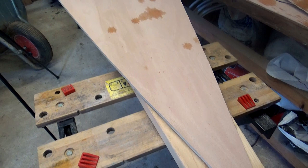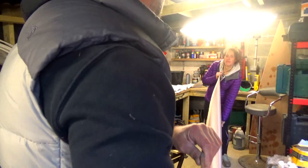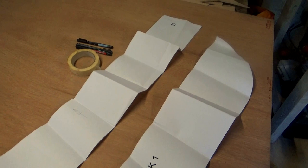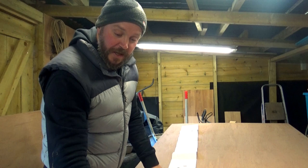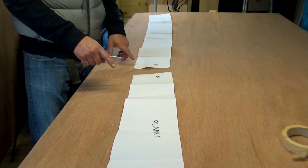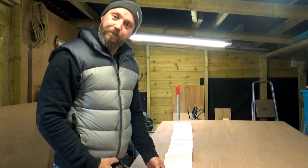As you can see, they're quite large plans — we're building a 14 foot canoe. What we have to do is cut out and stitch multiple parts together. We're going to mark out and cut the planks for plank one on the first sheet of marine ply. Because the planks are so long for the 14 foot canoe, we have to stitch multiple sheets together, mark them on the sheet — I believe we need four lengths of plank one and four lengths of plank two — then cut the lines and stick them together so we can stencil them onto the ply board.